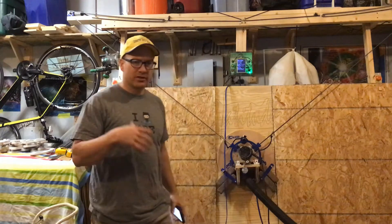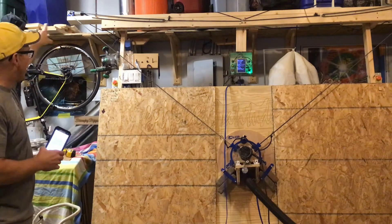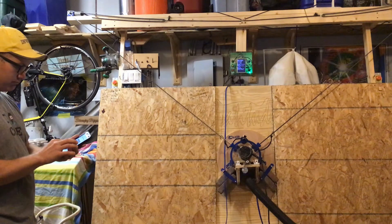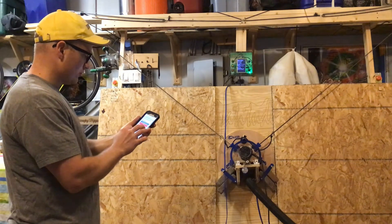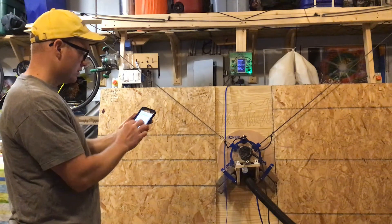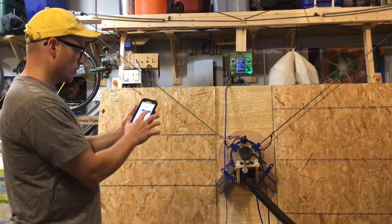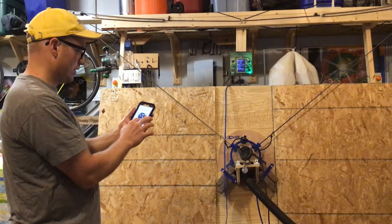Hey, I'm Rob. I'm going to show you how to calibrate your system. I'm in the bottom feed configuration so I have a ring. As you walk through it, it's kind of like a choose-your-own-adventure book. You go through the quick configure — it's the first step to set up. You go to quick configure and it asks: what kind of kinematics kit do you have? Do you have a ring, a linkage, a pantograph, or a quadrilateral?